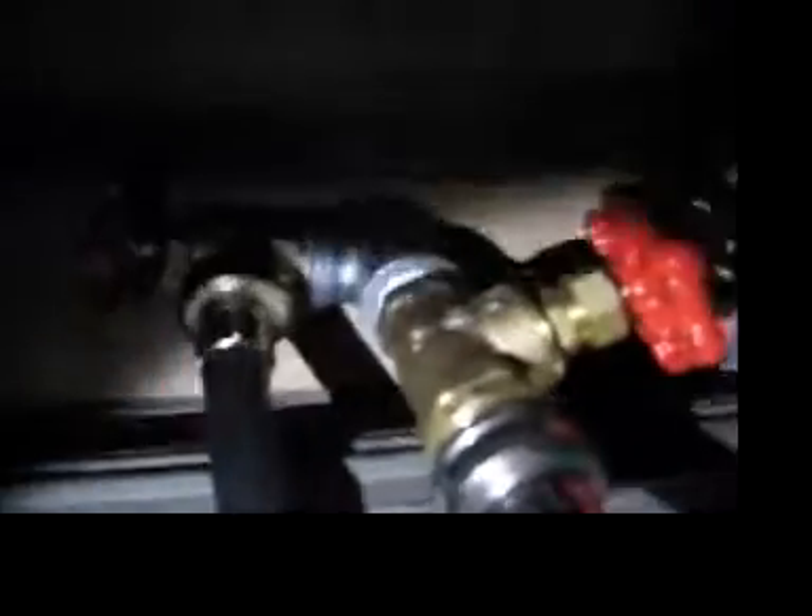On the opposite side of the window, you can see two nipples coming through the header beam. One is an inlet — that hose isn't hooked up yet, but it will connect directly to the lower valve so you can draw from the lowest point on the rain barrel. That goes into the pump, and the high-pressure side comes out right here, where it's teed off into two outputs.